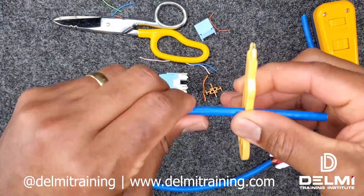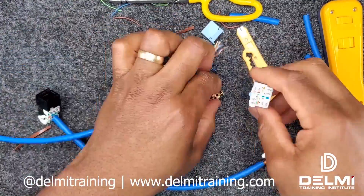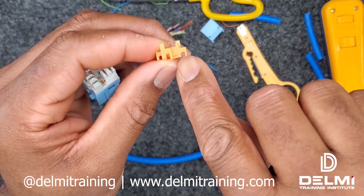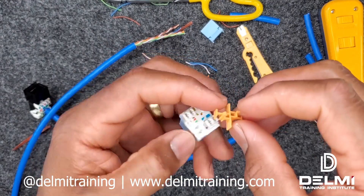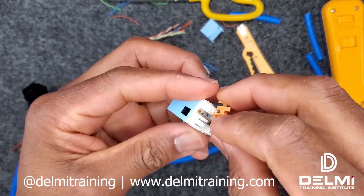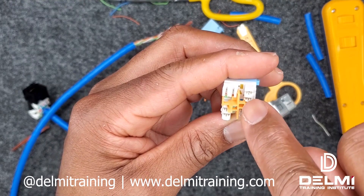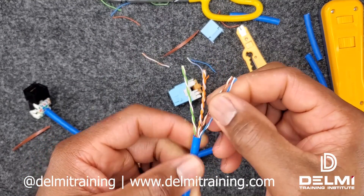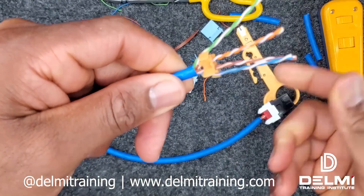I'm going to go ahead with my cable stripper and strip the sheathing off the cable. With my cable separator — same as what we noticed when doing this — it's got a groove on this side, one groove on that side, and also two pointed sides here that stay up while the flat side goes within the jack. On the top you've got four grooves. So I'm going to arrange them in the blue, brown, orange, green fashion — I'm going to align them blue, brown, orange, green, fit them in, and then push it all the way till the end.